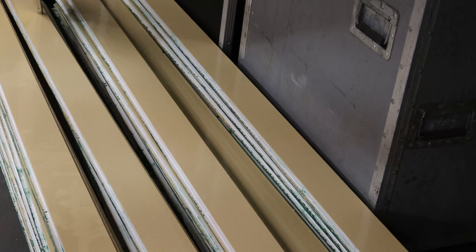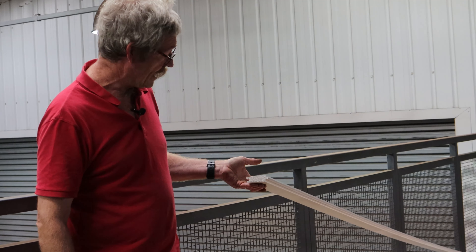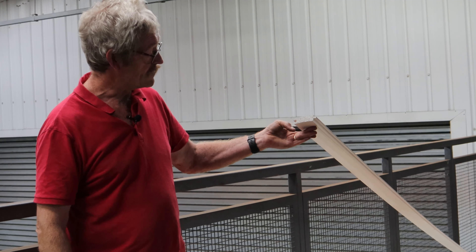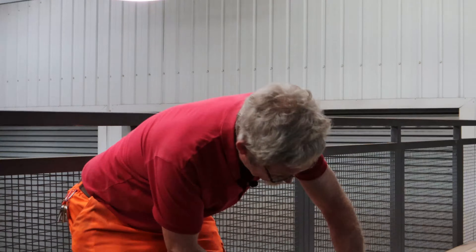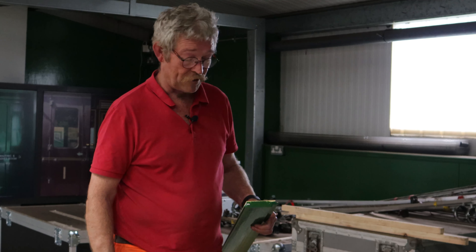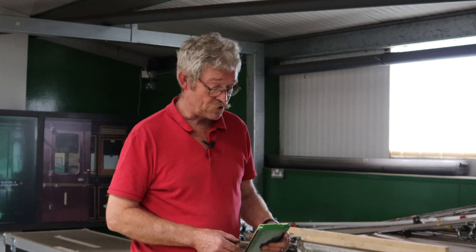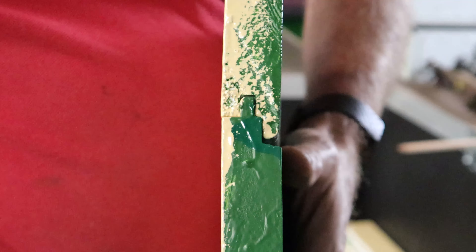These are all the roof boards which will eventually make up the roof for the BY. We've painted the inside with gloss paint and once it's all fitted it'll get one more coat in situ. The small pieces have been machined with a radius so we can get around the tight corners on the edge of the roofs, and that's done before the tongue and groove gets machined into the boards. The larger boards which go across the middle are flat boards just with the tongue and groove on. One interesting detail: when we cut sample pieces from the side we noticed the tongue and groove was not the standard type you'd get at B&Q. So I took samples up to White Hill in Luton and had the cutters made to match the original profile, and I'm quite proud of the result.